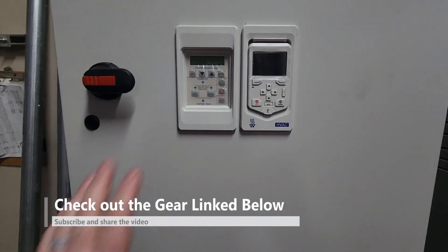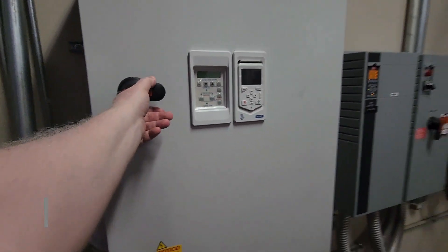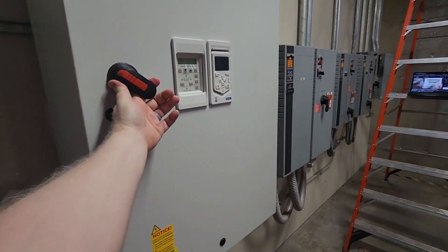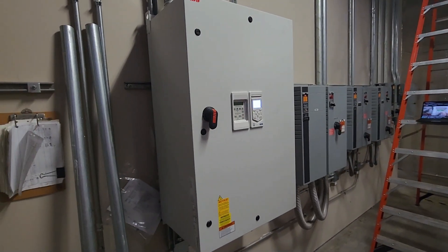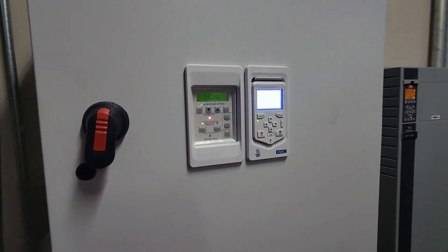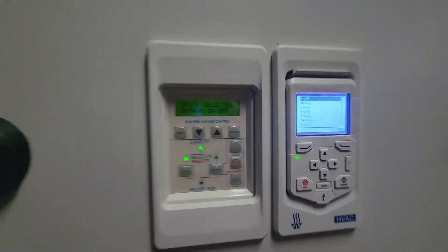Now that we have got everything verified as far as our wiring, we are ready to turn on power. I always step over to the side when I turn power on one of these, and there are times where I will actually just turn it on from the remote breaker. But right now let's go ahead, hit the switch, and see if the drive lights. We can see that we do have the drive initializing. We've got to go through and set up all of our parameters.